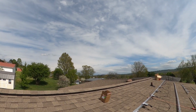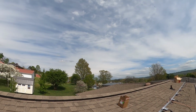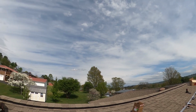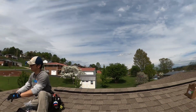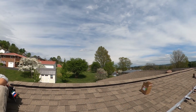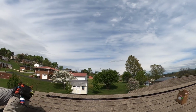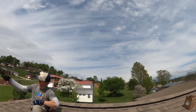Also, you have rapid shutdown capability because the panel is turned off at panel level, so you only got like 30 volts or something like that, instead of, with a string system, you're gonna have pretty high, 500 volts or whatever. Depends on how many panels are in series. So it's a really cool thing. I really like them. Great for checking out the systems and troubleshooting. If you have some shading issues, it's not going to affect the rest of the string. Even though they are wired in series, they still operate independently.